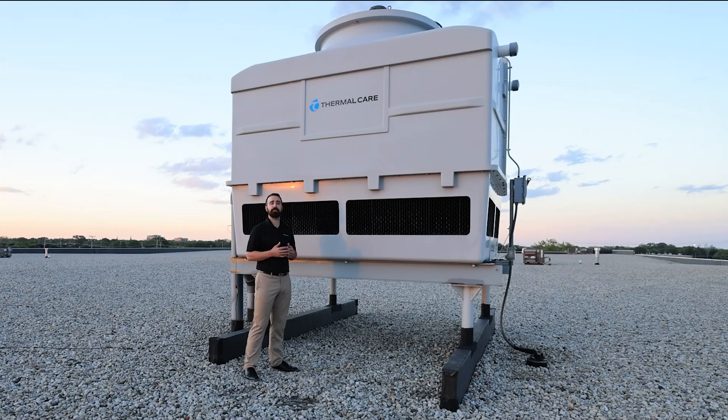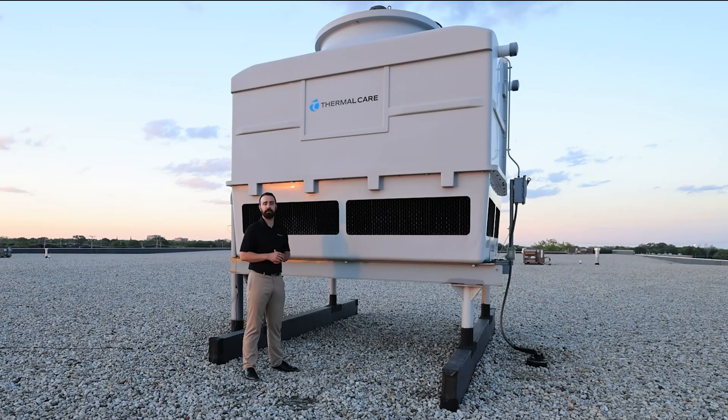This makes it simpler to note that a 100-ton chiller is going to need a 100-ton tower. If you did not have those two different definitions — chiller ton versus tower ton — you would actually need to say a 100-ton chiller requires a 125-ton tower. So it helps to eliminate that potential source of confusion.